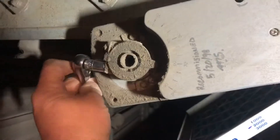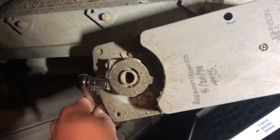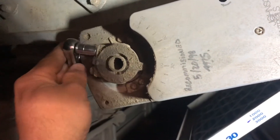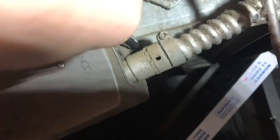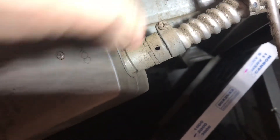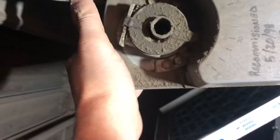So we're going to replace the actuator. First we'll start by loosening the 10mm U-bolts that hold the actuator to the shaft. This is the shaft that drives the outdoor air damper. Then we'll loosen the screw on the back tab. Looks like we have to completely remove this screw. We have the screw out and the U-bolt — it's off. We'll pull it out.